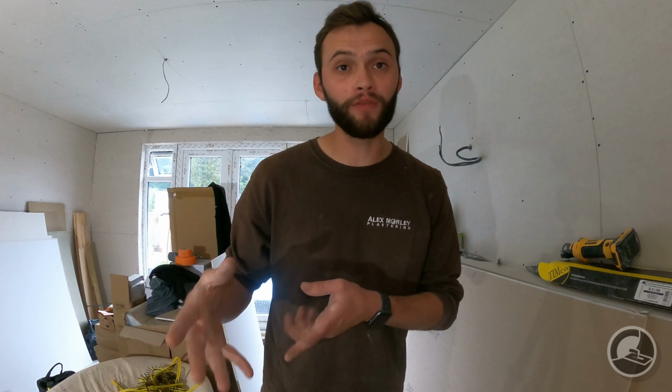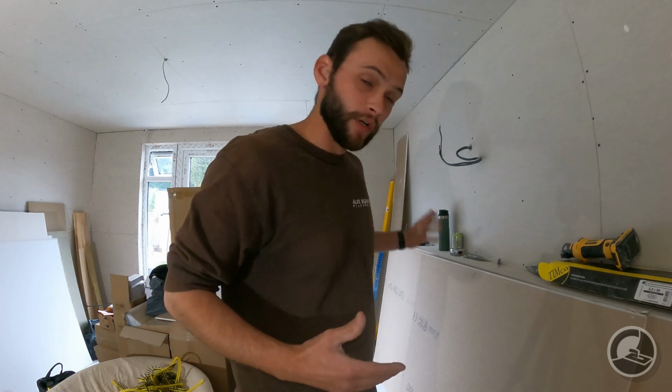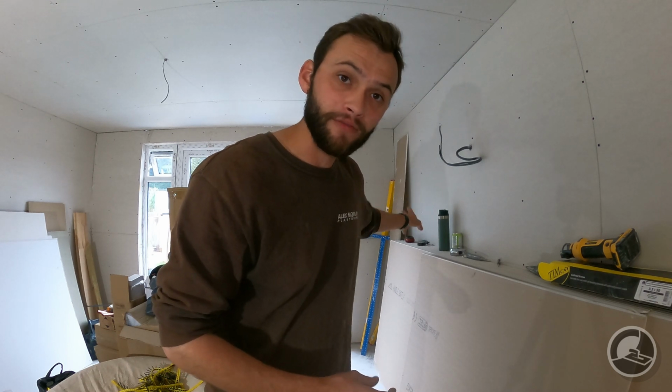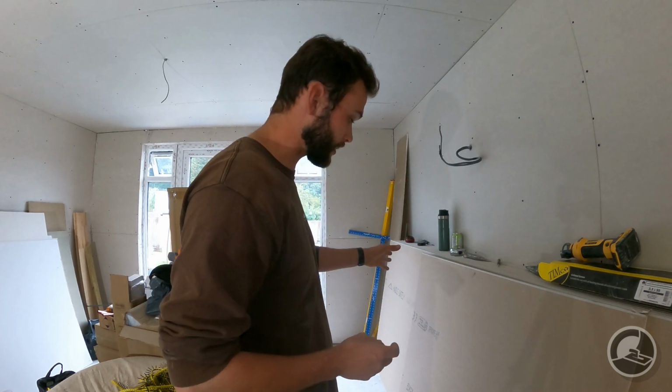Now, there is an element of, if it's 5 to 10 millimeters out of square, you can still use that as a straight edge, but it works best when you're doing square, repetitive square cuts across its width. It's an awful lot faster than using the level, and in my opinion, if you've got a good square, it's a bit more accurate. So when you're doing cuts across the width, that is very effective.